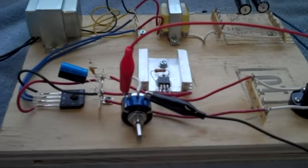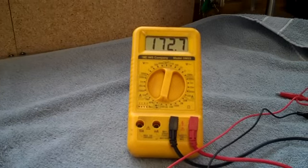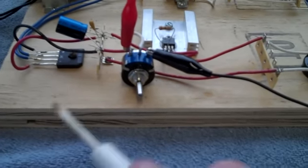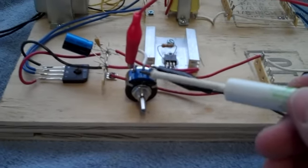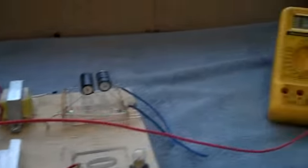I've got it hooked across the two connectors — the outside one and where the jumper is — and we're reading 172.7, 173. That's good. Now, we're going to go ahead and remove it and take another reading, because there's a possibility it could be reading different in the circuit than it does outside of the circuit. What we get outside of the circuit, once it's removed — we're just going to remove one side and then go ahead and read it. That's the reading we're going to go by, not the one we're seeing now.